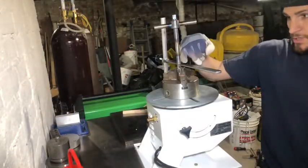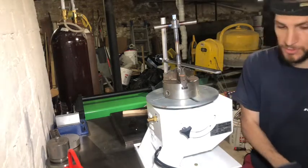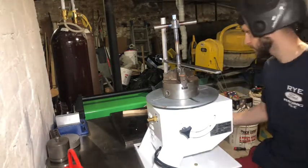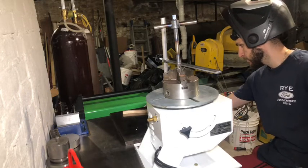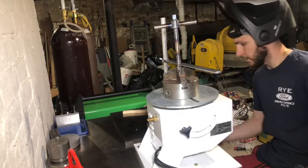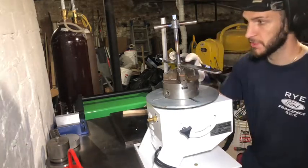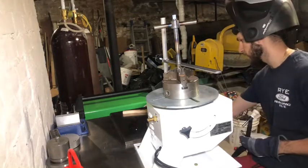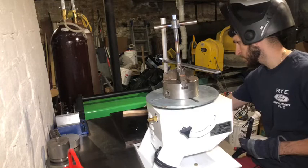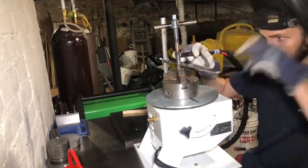I was having some weird issues with the bottom one, which is on top, so I took it off and cleaned it really good and it seems to be okay now. I'm dealing with 120 amps, 10% on-time, 45% background, and three pulses a second. This is just a cleaner pass — no filler on this one, I already added the filler.